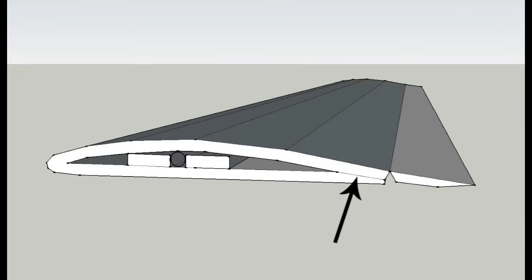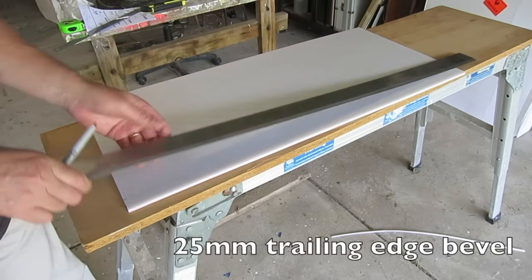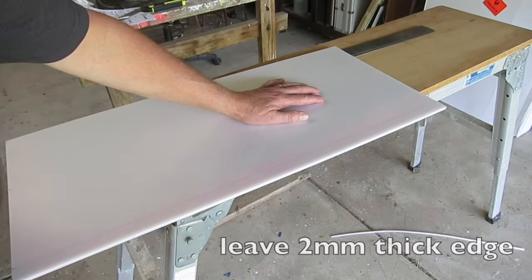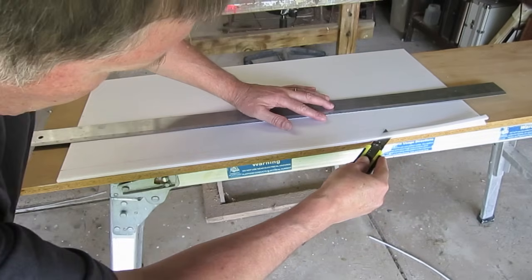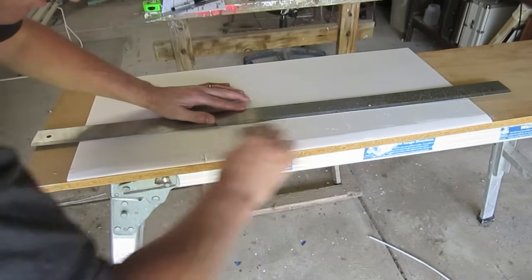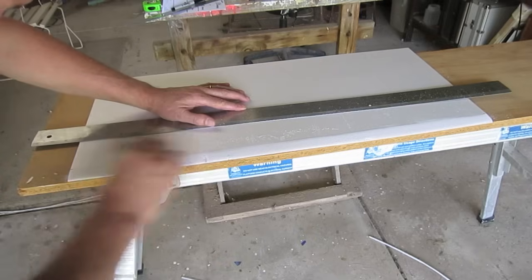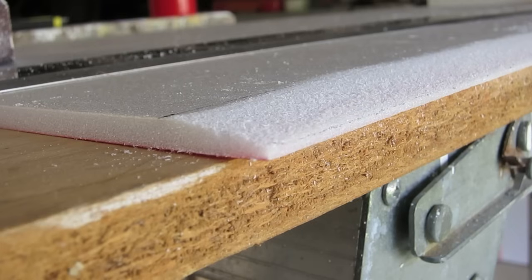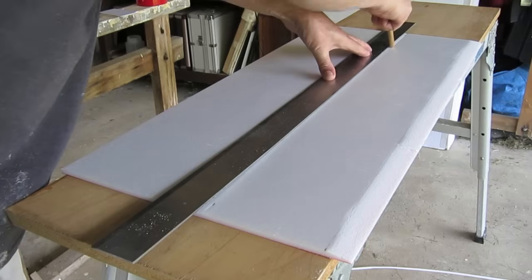For the leading edge fold, it's 150 millimeters or six inches back from one edge — just marking those positions. For the sub-trailing edge glue line taper, I'm marking 25 millimeters from the edge and then 2 millimeters up from the tape surface, and then slicing that off and sanding it down.